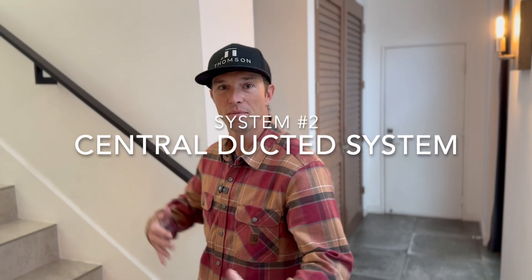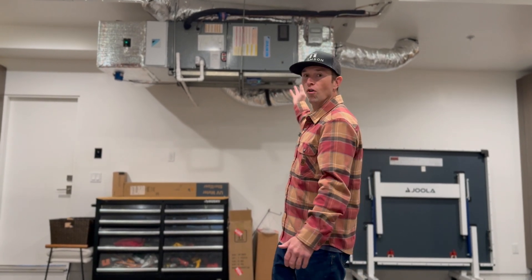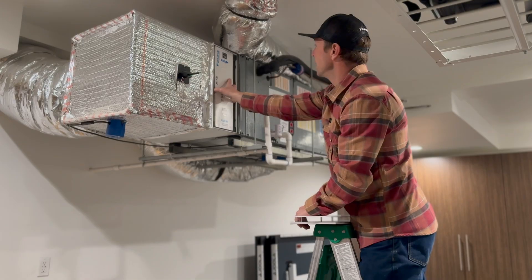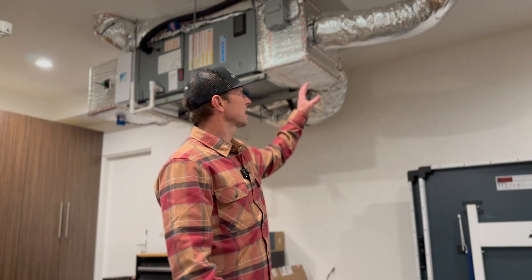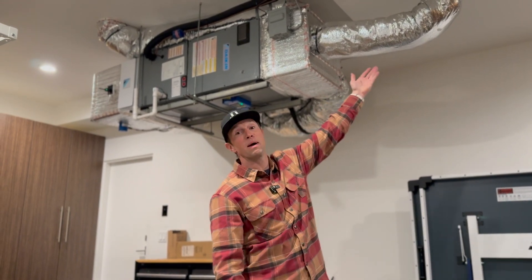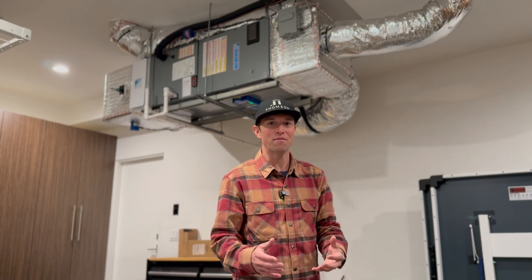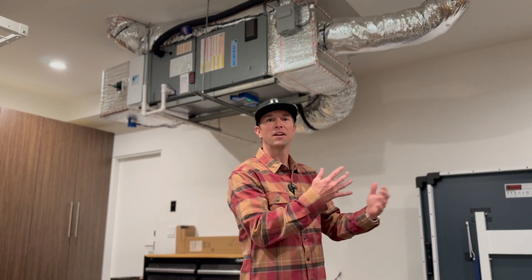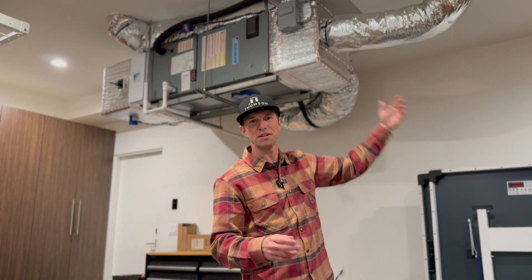The back of the house deals with everything from the staircase backward — handling the master suite upstairs, one bedroom downstairs, and a bit of the hallways. A system was already hung in the garage, and since space wasn't an issue, we were able to hang a full blown fan coil there. I also like the idea of good air filtration and sanitary air, so we have a media filter on the left, an air quality monitor, and a UV light installed. The ducts go straight up into the master bathroom via a really short duct, which gives us a little extra wind noise — something to consider if you have a unit in the garage next to a bedroom. I'm okay with the noise in my bathroom; the fix would be to run a longer duct, but I don't want extra ductwork visible in my garage.